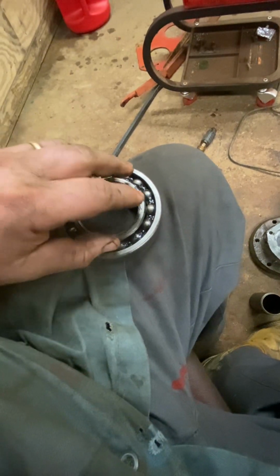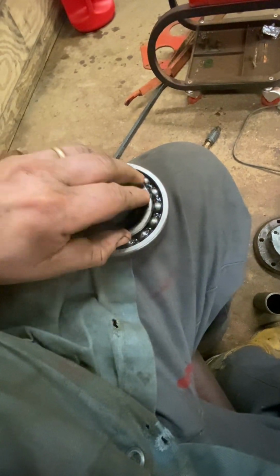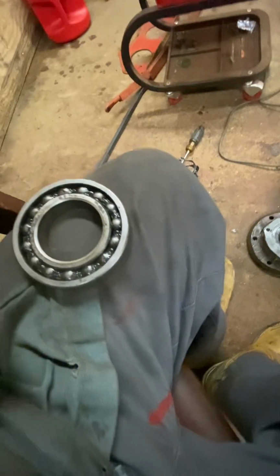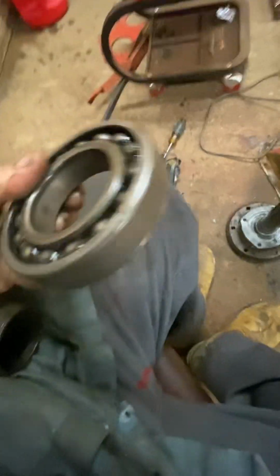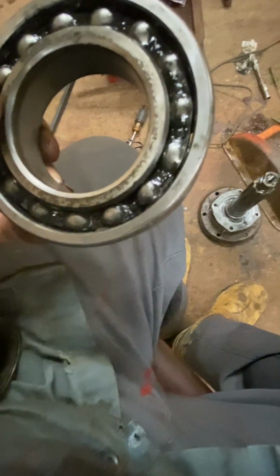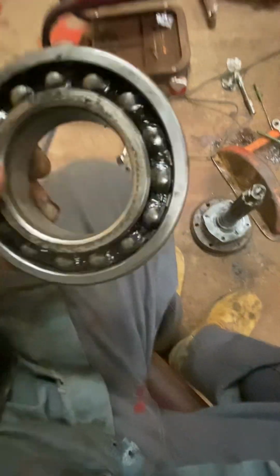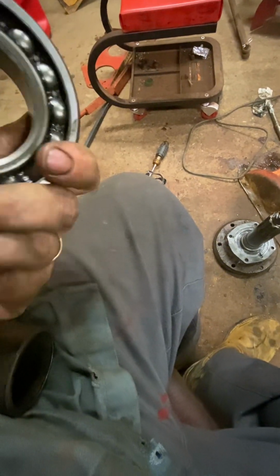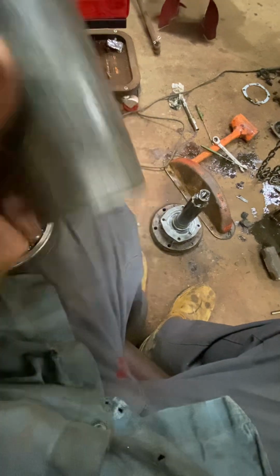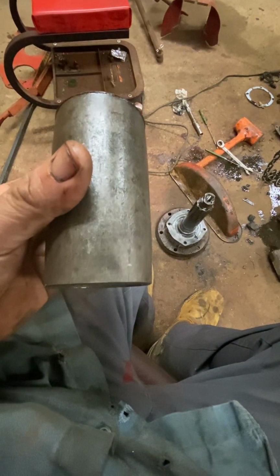across here, and we're gonna set that on shims on top of this bearing, so this spacer will lock onto this bearing now. See, this bearing has spun around in there so long, spinning on the axle, not being locked together, it's beveled the inside of the bearing. All right, and this is beveled and mushroomed out too. So in other words, this has gotten shorter over the years.